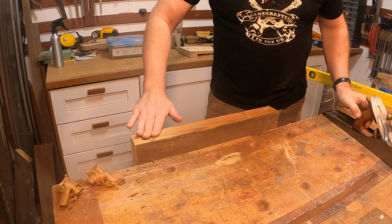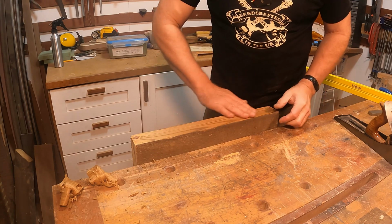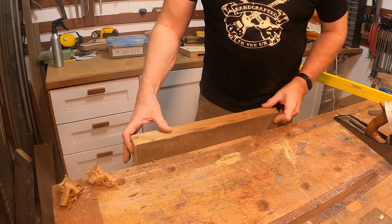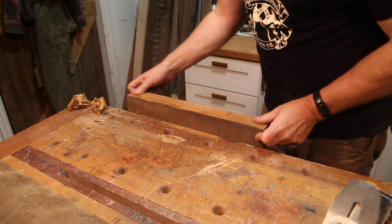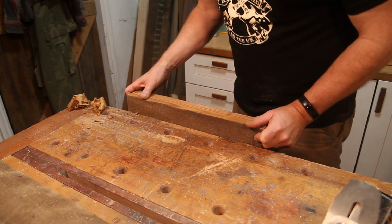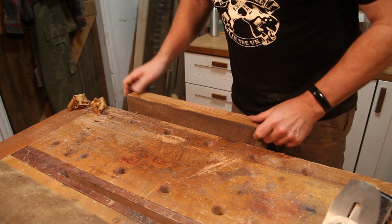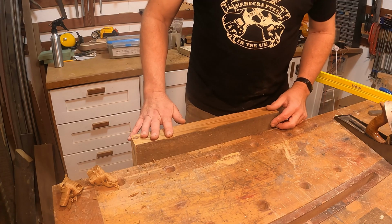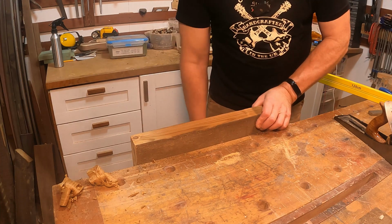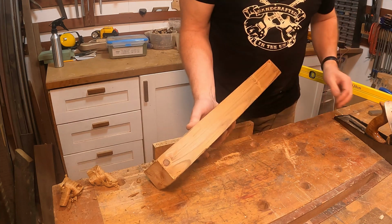And this wood is cutting like absolute butter. It's beautiful. And you might be wondering how sharp that plane blade was after sharpening. I think the simple way to say it is it's absolutely razor sharp. It would be easily sharp enough to shave hair off my arm, but I'm not really into that kind of thing, if I'm honest. But it was sharpened to 4,000 grit and then stropped, so it is extremely sharp. And that's what gives you this absolutely beautiful finish.